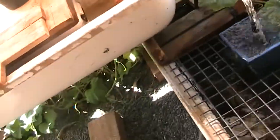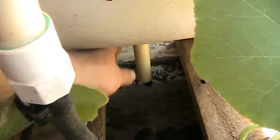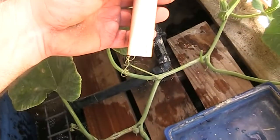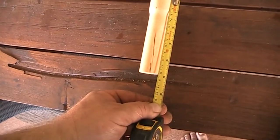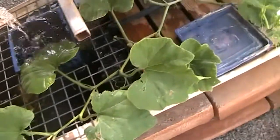I'm going to change the bottom of the tube as well. I've also lifted the bath up ten centimeters because the siphon was having a lot of trouble getting started. So I've made a small tube which is about 130 millimeters — it might be 14 centimeters long — but because of the coupling coming out the bottom of the bath there's about a one centimeter difference, so it basically gives me another 13 centimeters of length, and that has helped get the siphon started and maintain it.